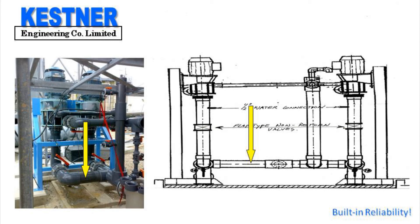It is recommended that the suction line be at least one diameter larger than is required by the pump. It is also recommended that a water connection is installed in at least one of the suction lines, just below the pump. The principle is that the overflow liquid from the running pump fills the standby pump and keeps it primed at all times and vice versa, facilitating quick and effortless changeover at any time, irrespective of the liquid level in the sump or the tank.